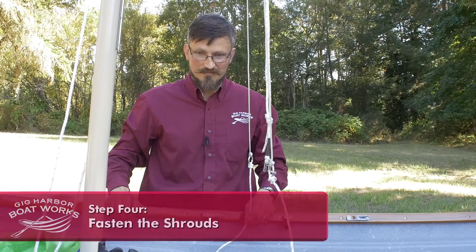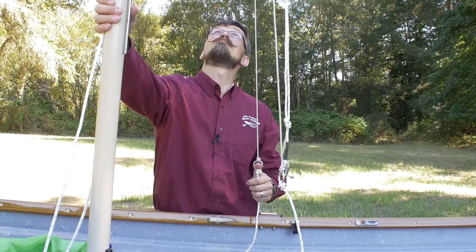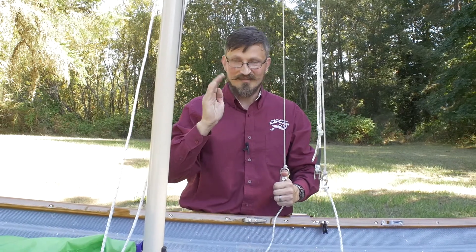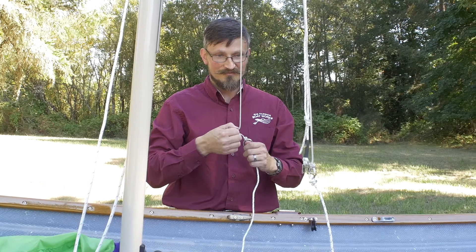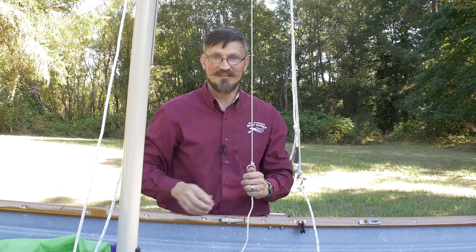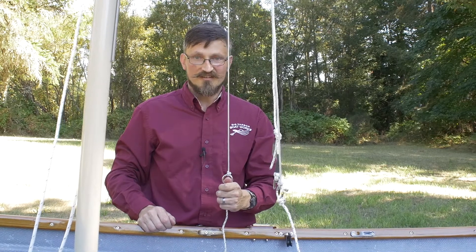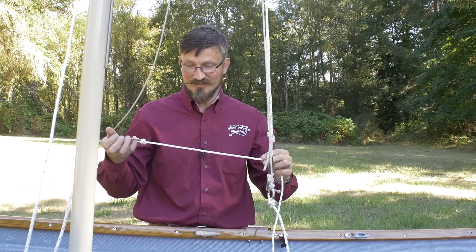Once you have the mast up, the next step is to fasten your shrouds. These are pretty important when you have a sloop rig because while the mast on a small rig like this is strong enough to hold up the sails, when you put a forestay on this rig it has a lot of leverage pulling everything forward, and your shrouds are here to make sure the mast doesn't move. On bigger boats you may be familiar with the stainless steel variety. They're good at what they do, but unfortunately they don't pack down very well. Since we take this rig down at the end of the day and stuff it in a sail bag, we use Spectra. Spectra is actually stronger than stainless steel pound for pound — it's incredibly versatile, incredibly strong, and there's very little stretch to it. It's also very slippery, so we have a little tail on the end so we can tie a knot and have it stay put.